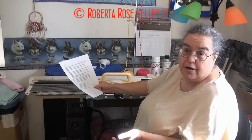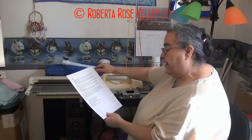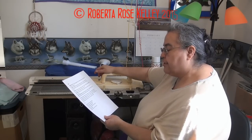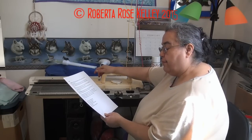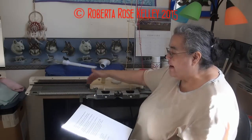There's somebody I know who has used WD-40 for about 30 years on all her machines and has never had a problem. As I was reading further about WD-40, it's formulated with strong lubricating oils and other ingredients, and is a terrific product — it does not attract dirt or moisture to metal surfaces. That's something we need on our machines. But be sure to wipe off any excess WD-40. If you're going to spray it on your bed or on your carriage, wipe off the excess — don't let it drip down into the machine.